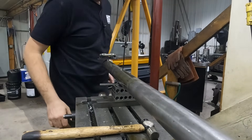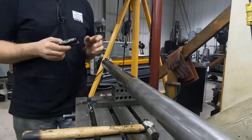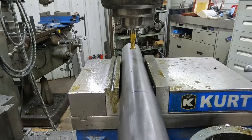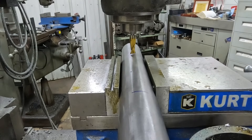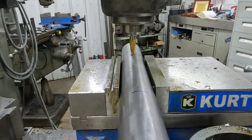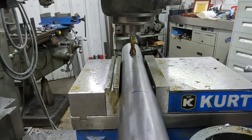If you want to do a super-precision in-line keyway there are better ways of going about it, but for the application this is going in, this is perfect. I'll bring it back over to center — I had to move it off center just to get the part out — 0.968. I'll bring the mill over to about center on the line there. The application doesn't require an absolutely perfect keyway. If I wanted it perfect I'd probably set it up on the planer mill or maybe on the horizontal boring mill. We'll go ahead and touch it off, zero the digital readout, and plunge it in 150 again.